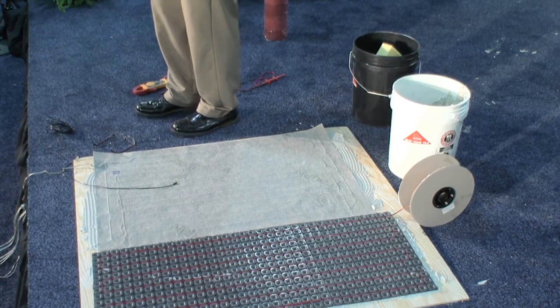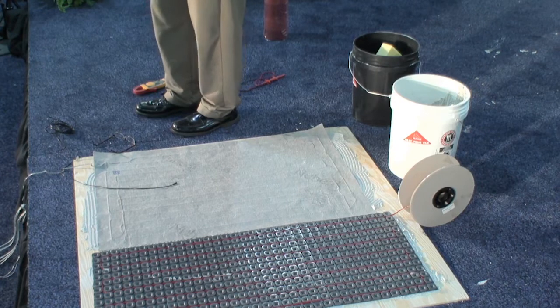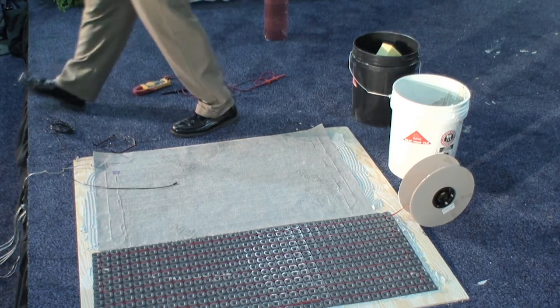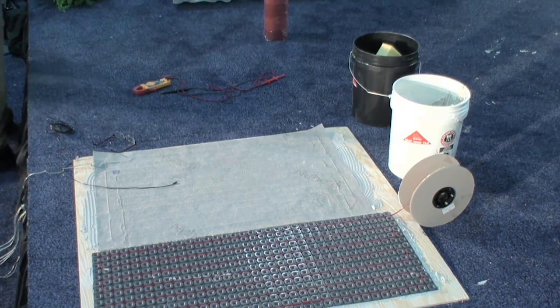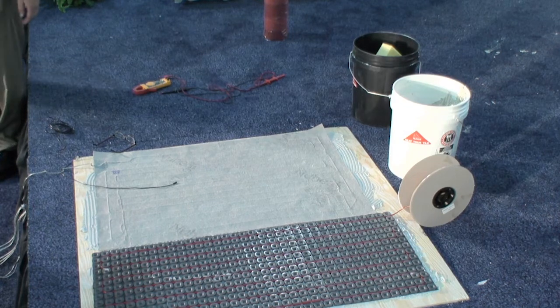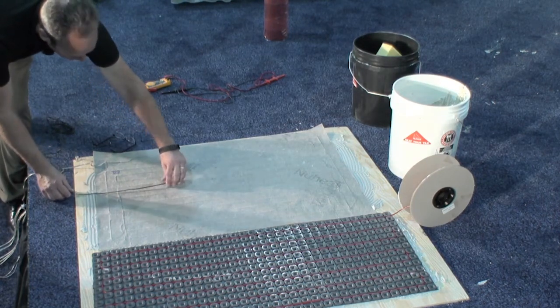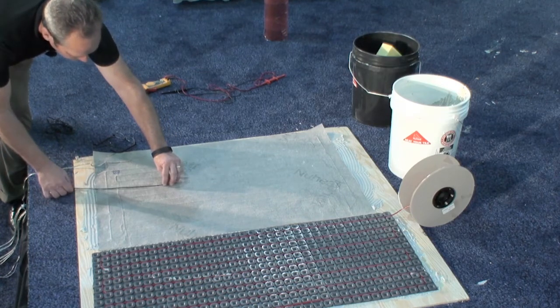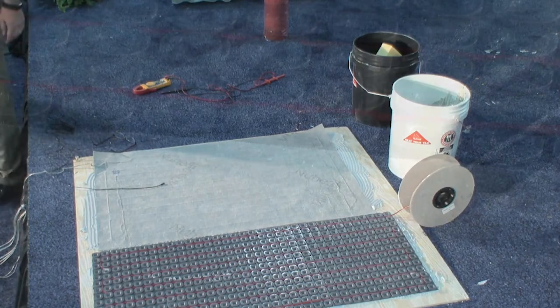That's going to be up to your local municipality. So I know in Illinois, it does require 2 conduit pipes, one for the cold lead, one for the floor heat sensor. So you're going to have a junction box with your thermostat, and then you have 2 pipes coming down the wall that are stubbed out at the floor. That's where I'm from. But I think in Wisconsin, you don't even need pipes. So it just depends.